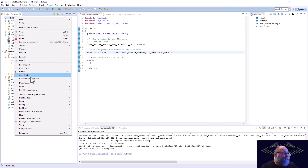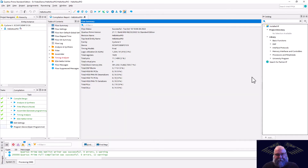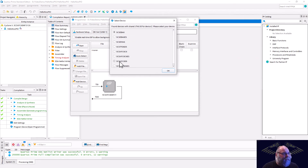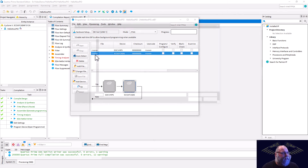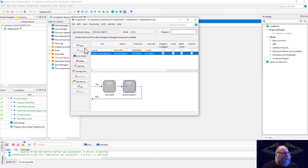We'll go ahead and rebuild the project. Let's go back to Quartus and check to see if our full compile synthesizing is done - and it looks like it is. So we can go ahead and program our chip. Let's save our file and then do an auto detect. We want to program the 5CSXFC6D6 chip which is our FPGA. The SoC HPS is the hardcore processor inside of the FPGA, by the way. We want our Hello NIOS PIO, and we'll hit start.